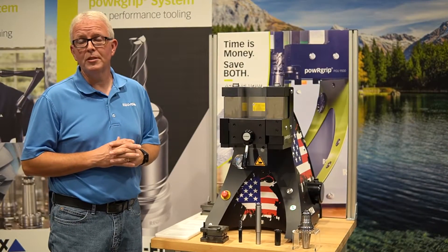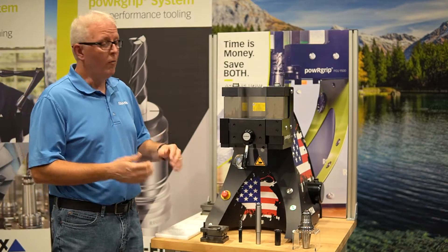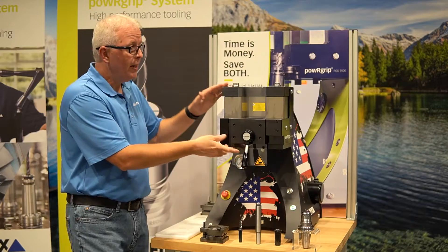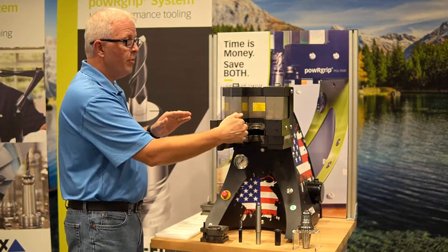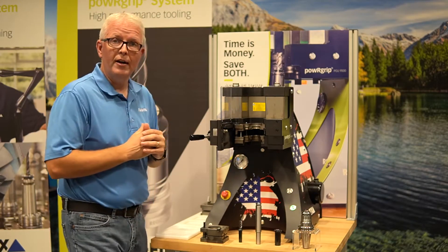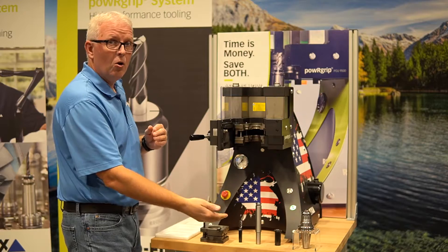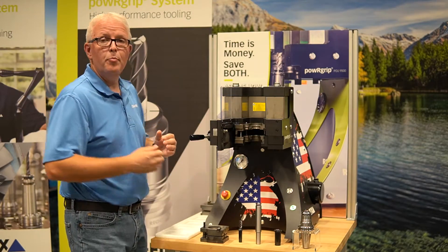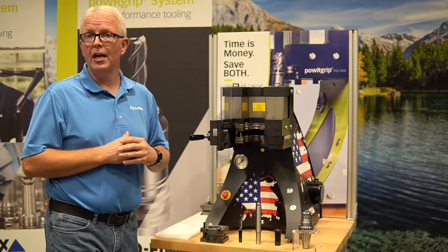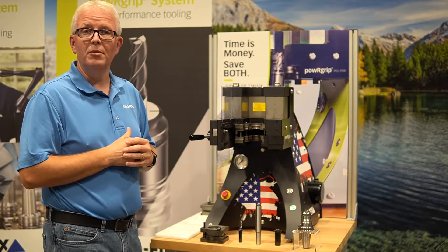Using the PowerGrip extensions is very easy if you're already familiar with your PowerGrip machine. What we have here is our PGU automatic, which already has our PG-25 insert in that. We have our PG-25 tool holder — in this case a 20 millimeter collet — our PG-15 extension, and a PG-15 half-inch collet. So let's go through the process and put this assembly together.